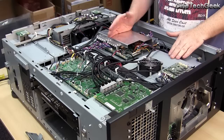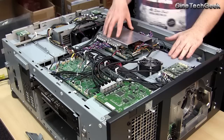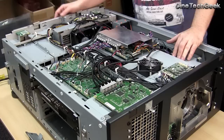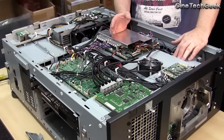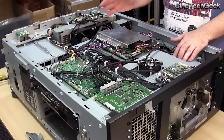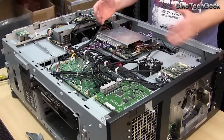Obviously the main reason this is interesting is that the light source isn't something you're going to replace very easily. But with a 14-hour duty cycle on a commercial cinema projector, this has a five-year life expectancy according to NEC. Some competitors have questioned that, but it's hard to believe NEC would give that spec unless it was solid. Using blue lasers on phosphor to generate light isn't new technology — it's been done for a long time in LED manufacturing and other parts of the industry — and now it's being utilized in cinema.